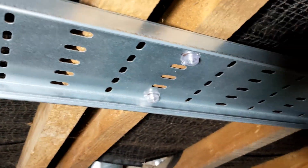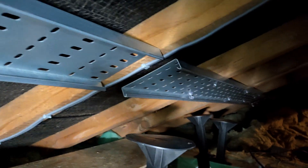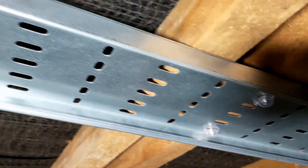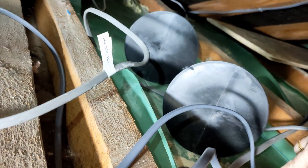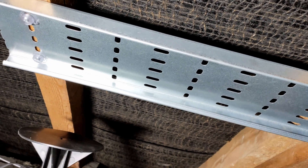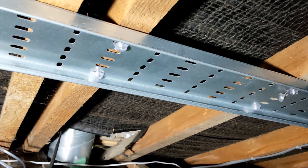That's the tray all installed all the way down. What we'll do next is extend the ring final circuit — this wire here has a very tight diagonal run so we're going to cut that. I'm going to lay four metres of new cable into that tray to extend the ring final, because we've got that stretched taut across at a ridiculous diagonal. So I'll go and get the 2.5mm cable, get that mounted into the tray, then splice that in.